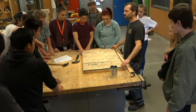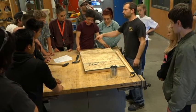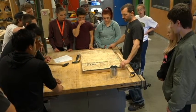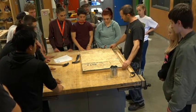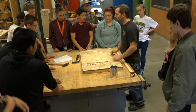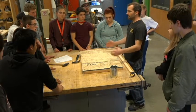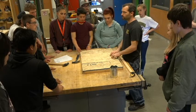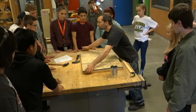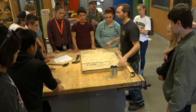What happens when they fix the other side? It makes the first side wrong. We probably want to do the long side first so that it makes it most square. So I'm going to pinch this side, square it up, and nail off this side. Once this side is tight and not going anywhere, then we can push the bottom framing to where it needs to go on the other side and square up your framing to this plywood. If we nail it as-is it's wrong, but if we just squish it over, it'll square up your framing.